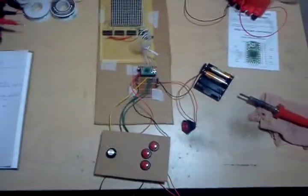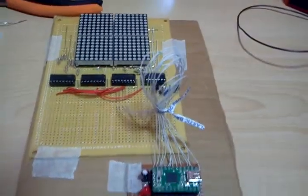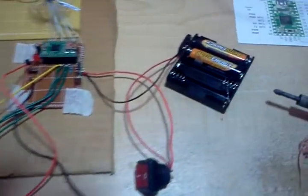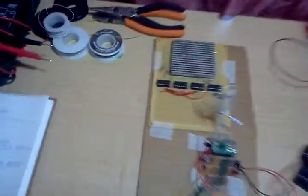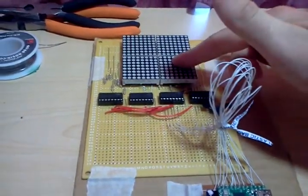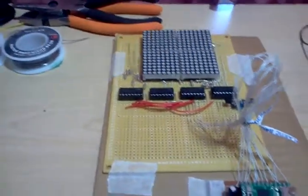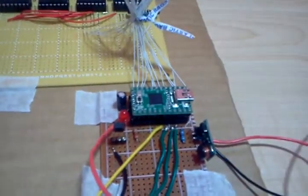Right here is the prototype testing platform layout that I've got hooked up for the moment. Most of the hardware that's going to be in the end device is here, minus the sound hardware, so it's silent right now. I got the display board done — this is based on 74HC595 shift registers and they're directly driving these LED matrices, so we've got a 16x16 display here. Here's the main control board, which has our Teensy 2.0 — that's the microcontroller — runs everything.